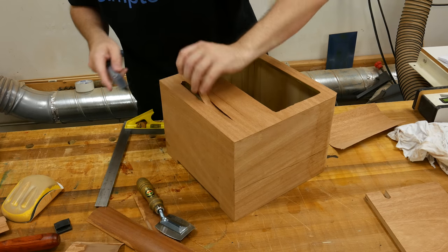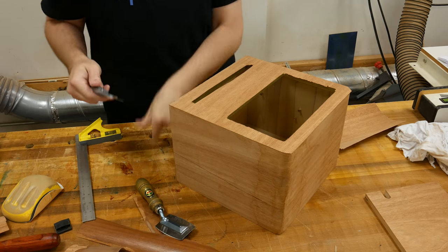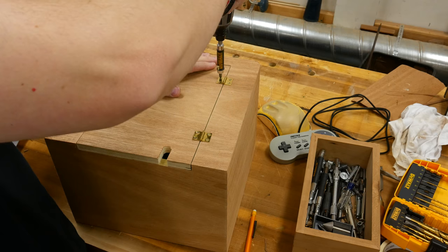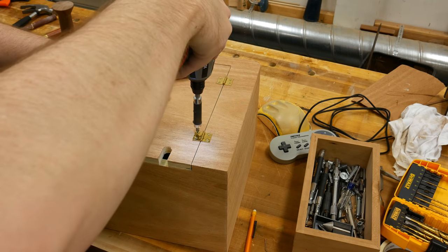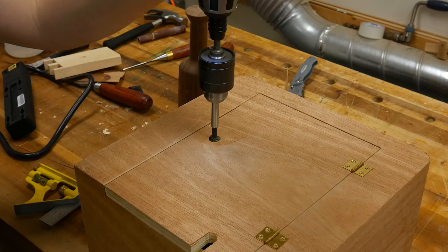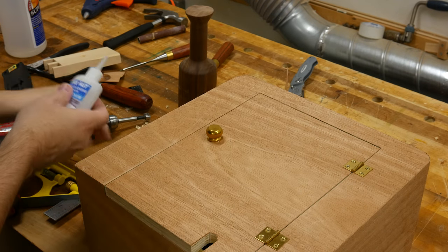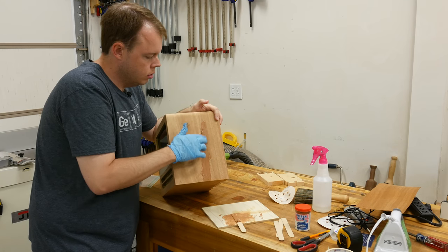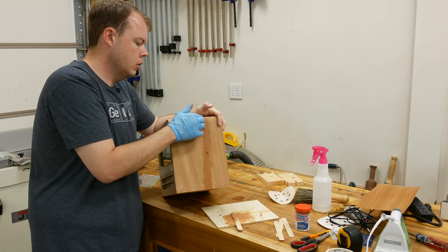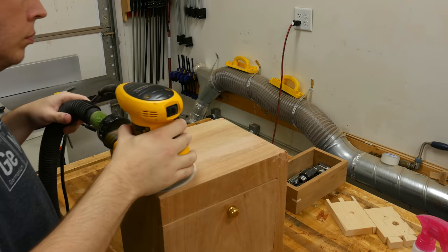With the front veneer in place, I had to take the screen and the front cloth back out for the second time, which made it easier to remove the excess veneer from the inside. FYI — just leave the screen and stuff out until last. On the back I put some simple cheap brass hinges on the back door, and I have some brass knobs that I put on the door as well. I drilled a half inch hole and held the knobs in place with some CA glue. To fix the rip in the veneer I used some Timbermate in the cherry color — it did a really awesome job. When the putty dried I hit the whole box with 120 and then 180 grit sandpaper to smooth everything out and remove the excess putty.